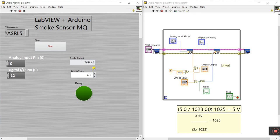I run the program, refresh the Arduino, and bring smoke near the sensor — you can see the LED is on. When I remove the smoke, after a few seconds the LED automatically turns off. When the value drops below 400, the LED turns off. For example, it reads 406, 405, 404... then below 400 and the LED turns off.